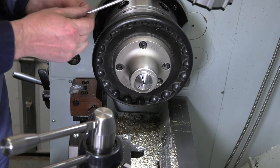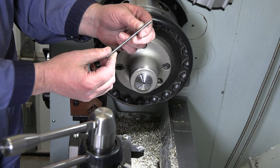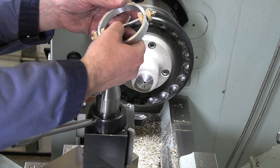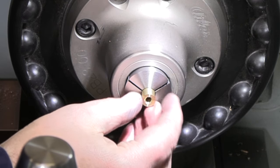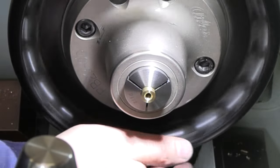And that should be the shaft done. Couple little grooves in there. Make sure those set screws lock in nice. We should be in good shape. All right, let's get our spacers knocked out so that they're where they need to be. All right, so I'm at 602. So I need to take off 90 thou.